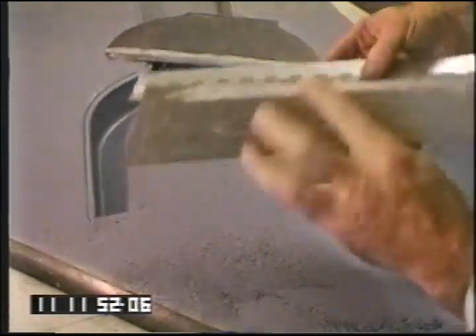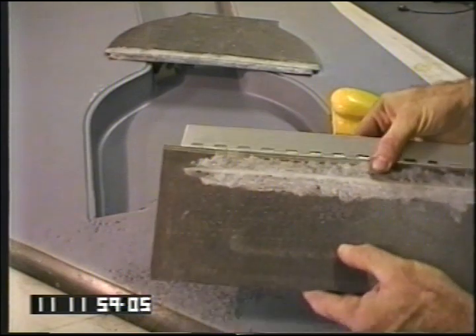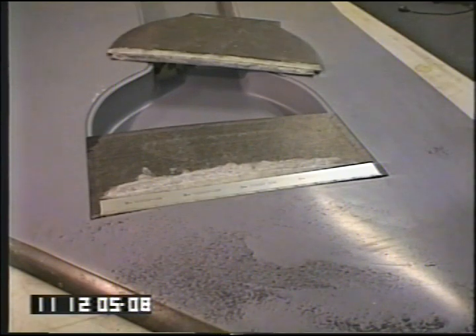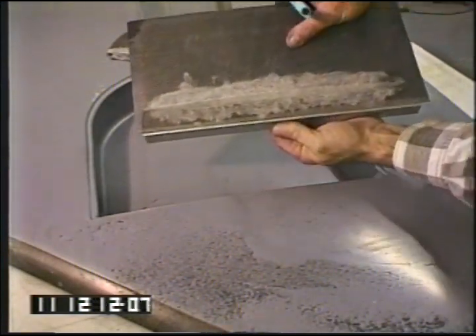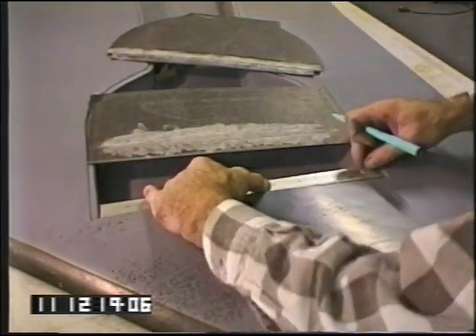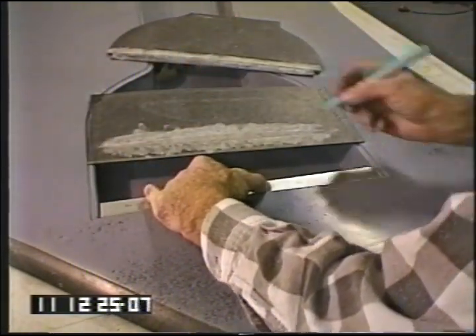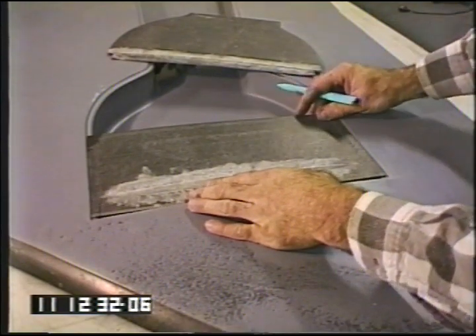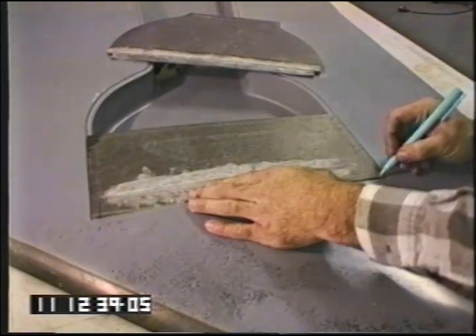Let's see how this looks. Much closer. Now we have the radius figured out — it nests in very nicely, neatly, all the way across, all the way up to the edge. Now we determine we've got the hinge equidistant here and here, missing the radius. I've put a mark, put a mark, come in here, check the placement — near about .15 out here. There are our marks, there and there.